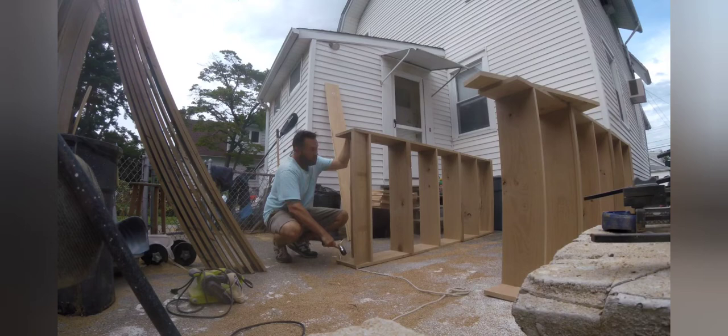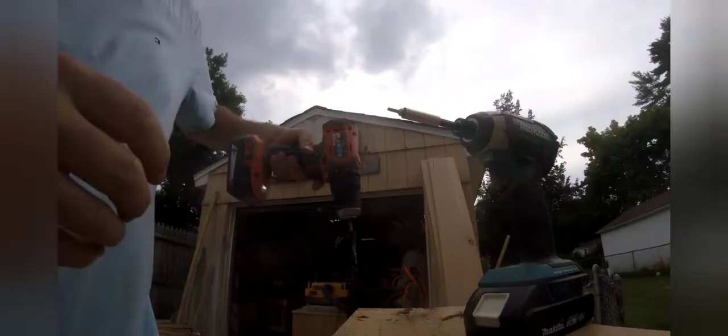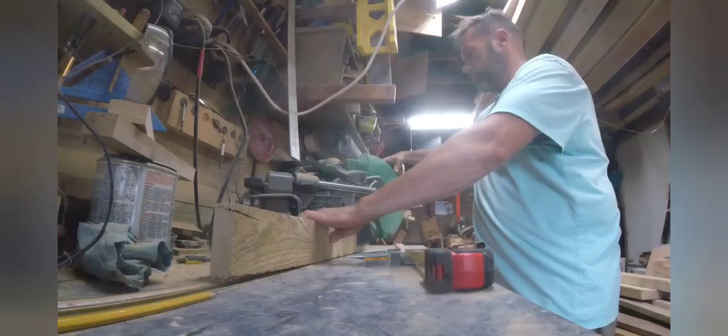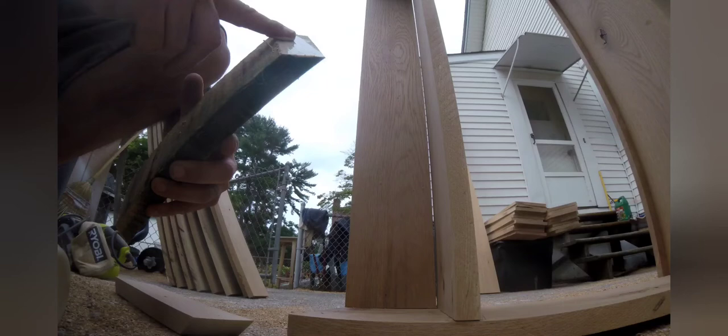And we're going to be putting 45 degree angle cleats, as you see here. We're going to put the back on, and then we're going to just grab now some cleats underneath to give them a little stability. That's all this is for. And the cleats in the back of the shelves are going to be for screwing to the wall and their studs. So here's the bottom pieces of the cleats, and there they are. So that just gives a little more stability, putting them on the floor, and that's how it's going to look. We're just going to brad now these in.